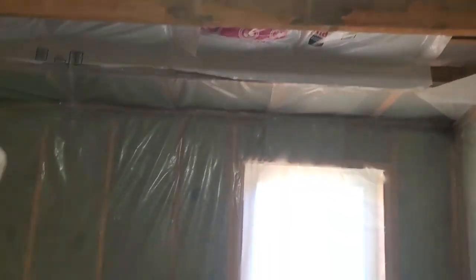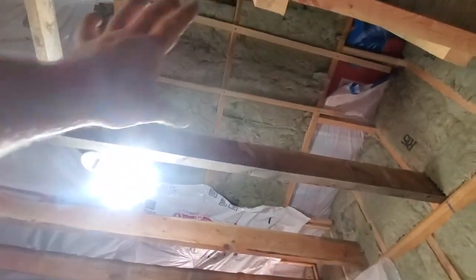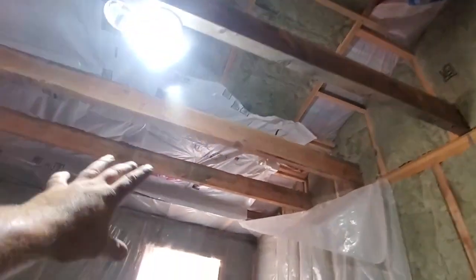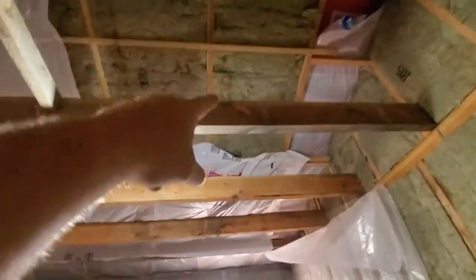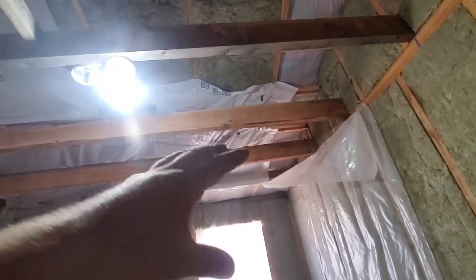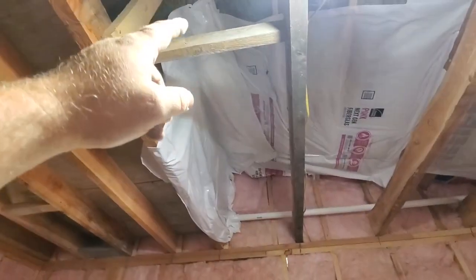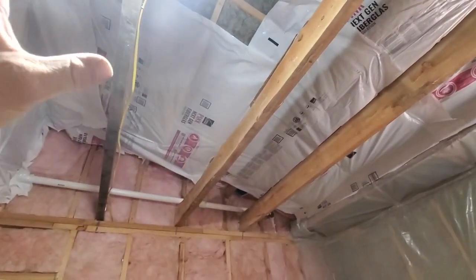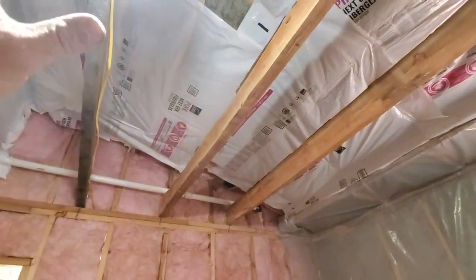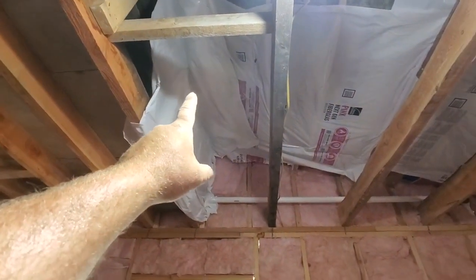Plastic and insulation. I gotta finish those two today. This is a weird room because I have this false air ceiling, and that's actually where the insulation is, but it's really hard to sort of plastic that. So my plan was I'm just going to go up this with plastic, and then I'll do the room normally. Problem is, being me, I've already screwed it up. It's fine that I'm using plastic scraps up here because you're really not supposed to have a double vapor barrier anyways. It'll be okay, though it's not that well sealed. I'm just, you know, hedging my bets.